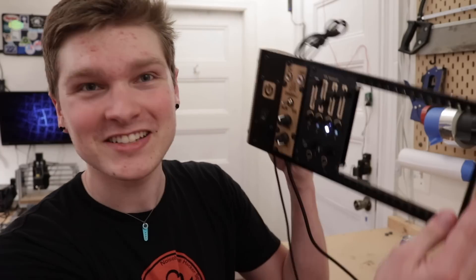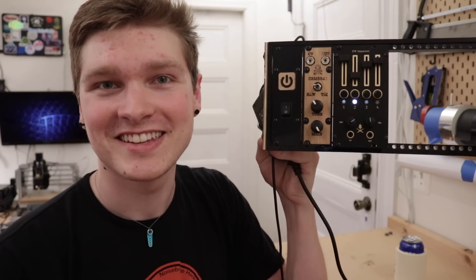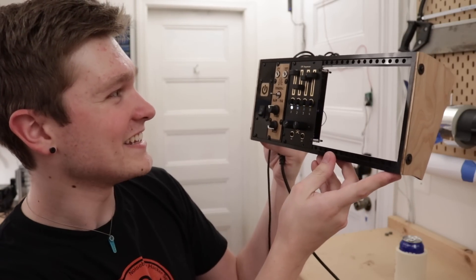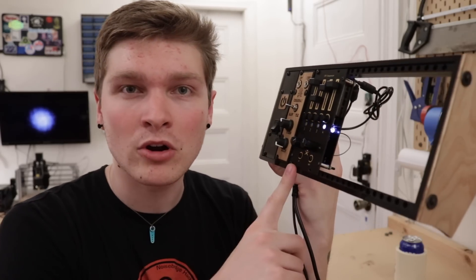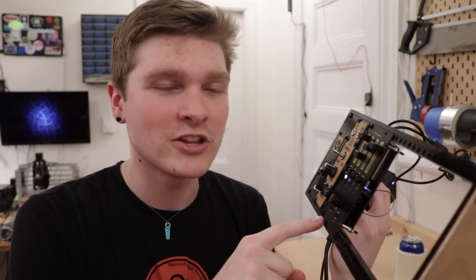It is not worth the heartache to design it poorly and just try to get it out the door quickly and then pull your hair out trying to get it to work. I need to just spend the time to design things the right way the first time. But we got there and now I have a sick new sequencer - minus one knob. I kind of like it with no sound just kind of flipping through like this. I still have a couple kinks to work out - the CV doesn't quite work right. My duty cycle on my signal is really high, so no matter what values I pick from my low pass filter it's pretty much giving me 12 volts. So I've got to figure out how I want to do that - that'll probably need a board revision to fix, but that's for the next one.